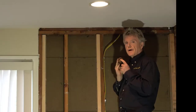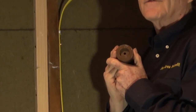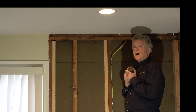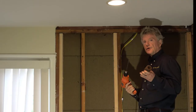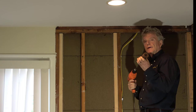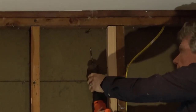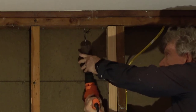I have this spacer made at a machine shop. As you can see, there's a hole right through the center of it — it's 7/32nds of an inch. We do that because the screw we use has a pilot hole that's 7/32nds of an inch. The first thing I do is put my drill bit through this jig right here, then hold it up to the top plate, and then I drill.